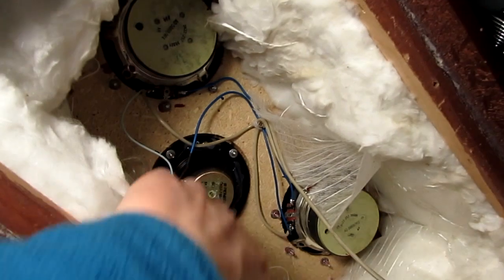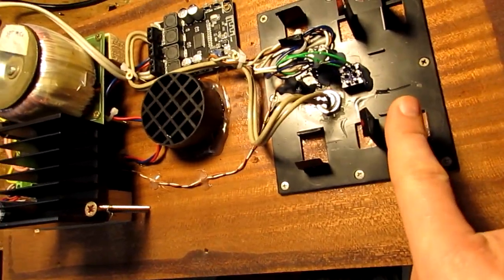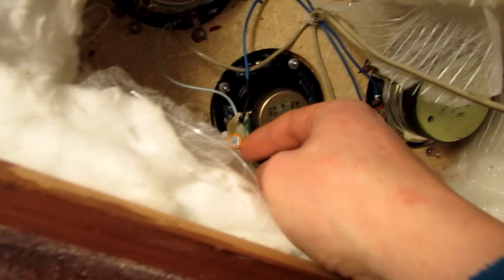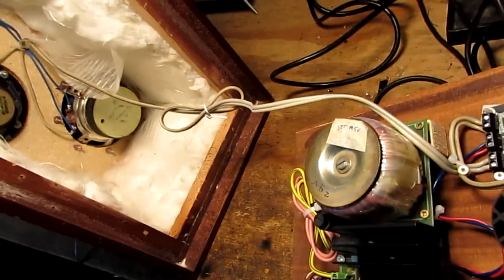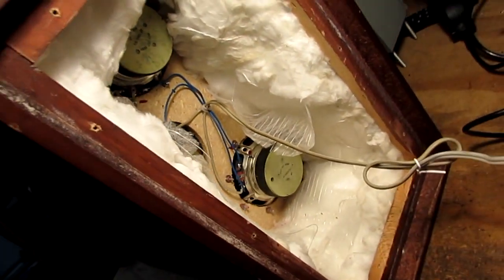You can find it also in the background here — you see there, that is the adapter. They also had a second-order crossover filter, but I have simplified this to a first-order filter with a simple cap here, because I don't like how the second-order filter they had works. So what I've done is simplify the circuit and make it active.